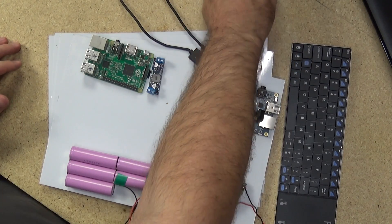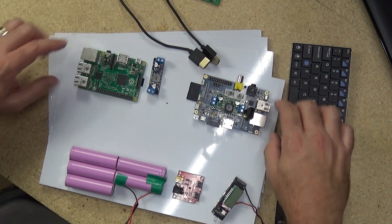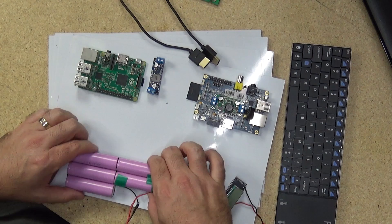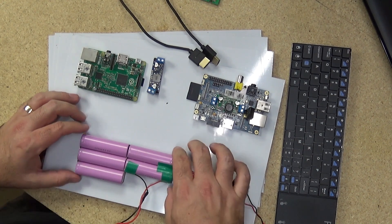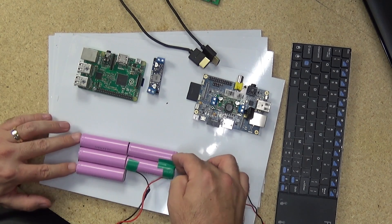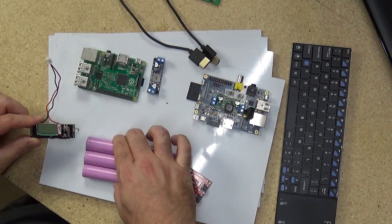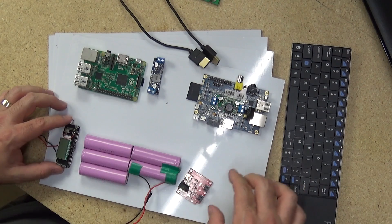In the top half will be the screen and the driver board itself. In the bottom half I'll have the two Pis, and they will be tethered via ethernet. I'll have a battery bank using this one I've taken out of the Doshin power bank, and I'll also use within the project the little display that gives us our voltage or our remaining power from the battery bank.